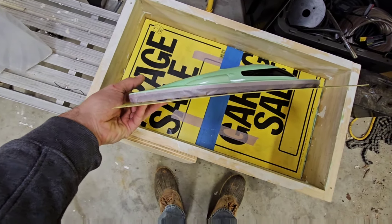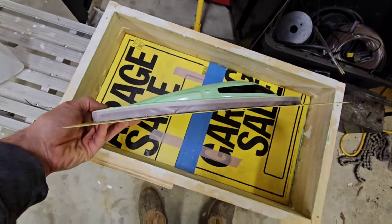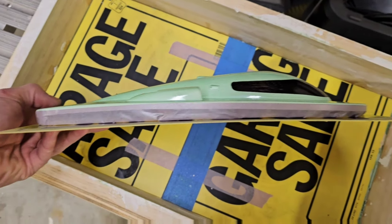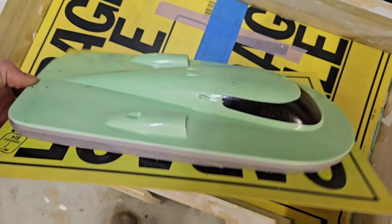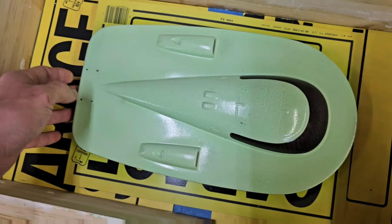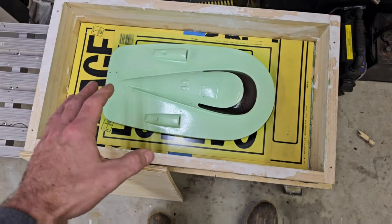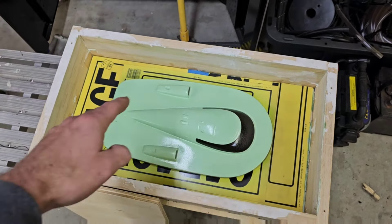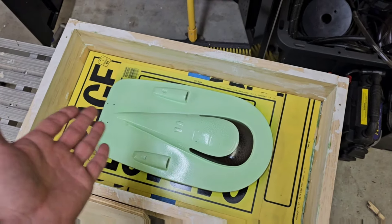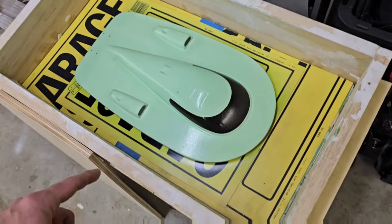What I did here: I made a box out of wood and filled it with plastic on the bottom — I just used regular old signage to gain some elevation. Then I took this sign — you can see how the sign is kind of curved — and glued it to the plastic so that hopefully my mold will get me that angle. Even if it doesn't, it's going to give me a square edge with more lip than I need, and then I can dremel in the edge once I pull it out of the mold. Right now I've got three layers of PVA on this.